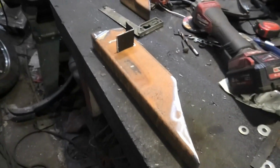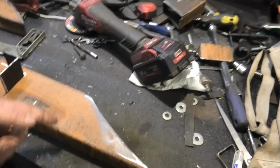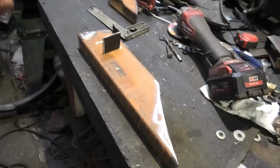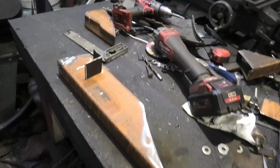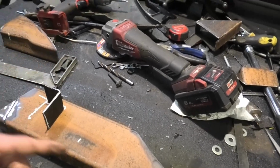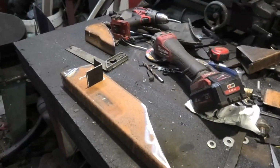You know those are going to blow to pieces, don't you? So we're going to drill a hole here next, run a bolt through, weld that on, cut that back, weld that on, drill a hole through that as well. On the bracket on the car, there is a snapped bolt that's got to be cut off, and then I'm going to run the bolt through that and bolt that on there, drill a hole, bolt that on there, and I'm hoping that's all I need to do.